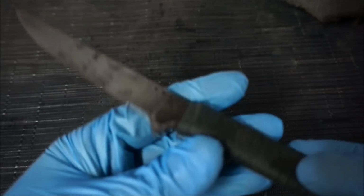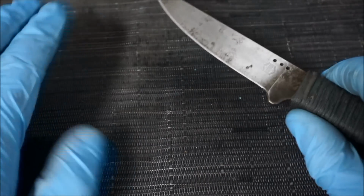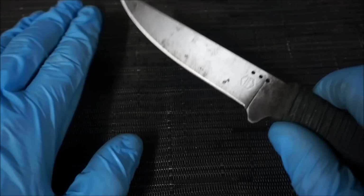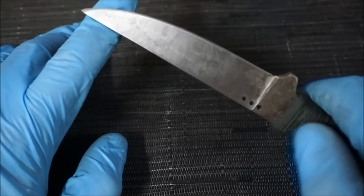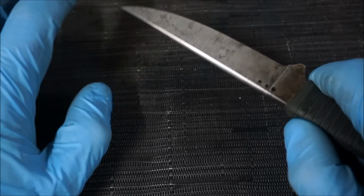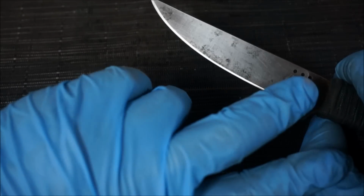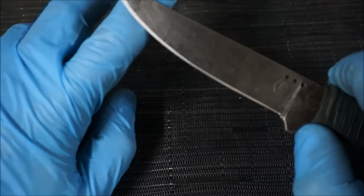But you can see I'm just going to stop this video again. So it's been about 2-3 minutes, and I've completely refinished the blade by hand with the Scotch-Brite pads. Now, we still have those deep rust spots left, but as I've said numerous times already, that's not going to come out without refinishing the blade. And I've also gone ahead and put a really quick edge on there with a 400 grit belt. So right now, this knife has been restored back to its functional point.